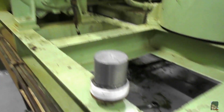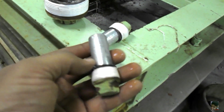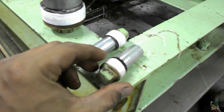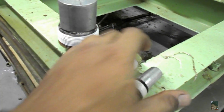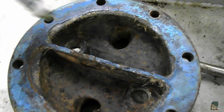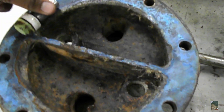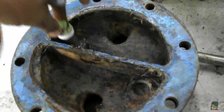As already mentioned, the working fluid is sea water, so to protect the material from corrosion we have some sacrificial anodes fitted to the body. Besides the general cleaning, it is absolutely important to check the condition of these anodes, and by experience you would know when to replace them. Failure to do this in a timely and routine manner would result in corrosion of the tubes and even the shell, and then it's a much bigger job to fix.